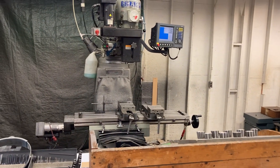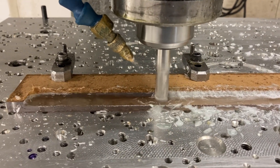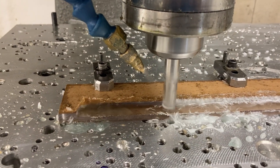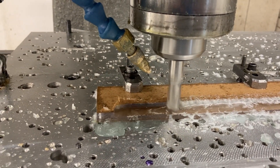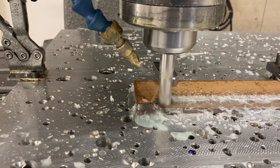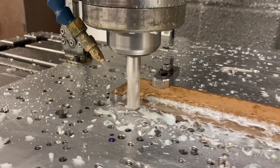While this one's running I'm setting the other one up over there - I've got some end holes I have to put in that Lexan over there. We're creeping up on 12 minutes here, and this cut needs to be 0.265 deep. First pass was only 0.160, so I'm going to go at it again, but I'll spare you the agony of watching that all over again.